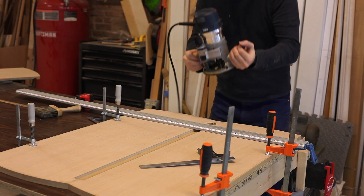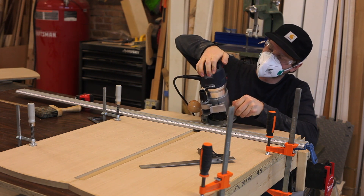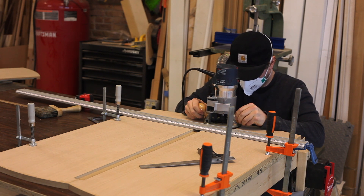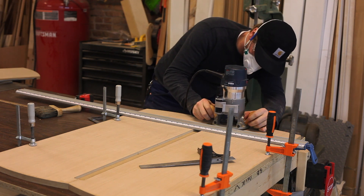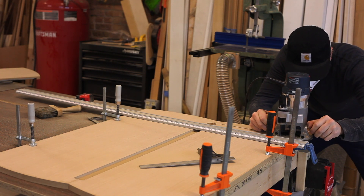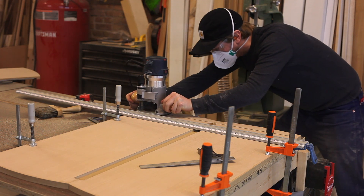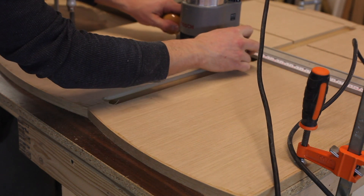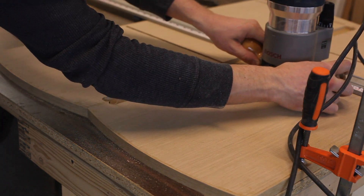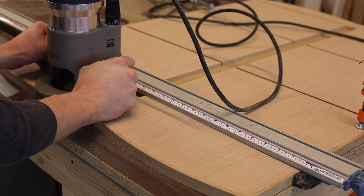When that's done, I'm ready to make the grooves for the shelves, top, and bottom. I'm using spline joinery, so all I need to do is cut quarter-inch dados into the sides. I'm doing stop dados on the top and bottom, and through dados from the back for the middle two shelves — they all stop about a quarter-inch from the front of the case. To be as precise as possible, I clamp down the sides so they won't move, then move the fence that my router rides along to the correct dimension where I want the shelves to go. I make sure that fence is square to my sides so that when I put it together nothing will be out of whack.